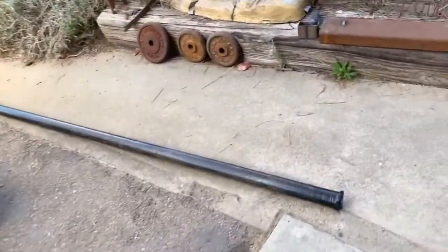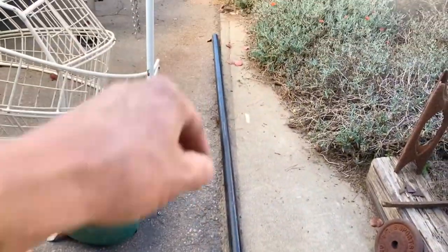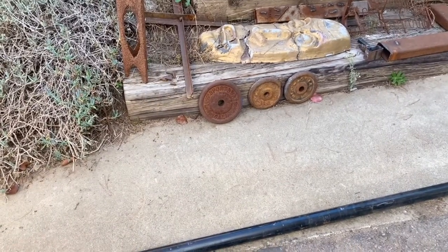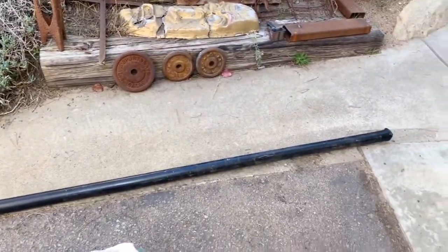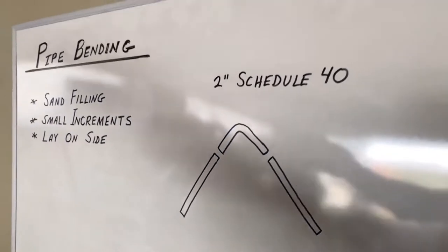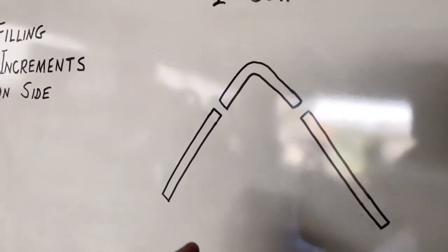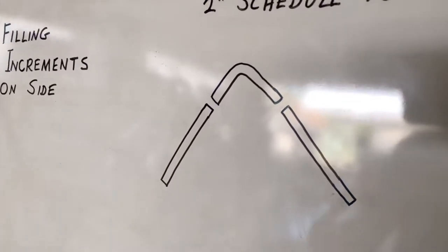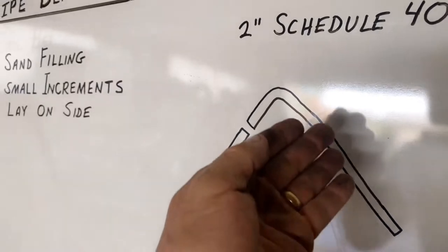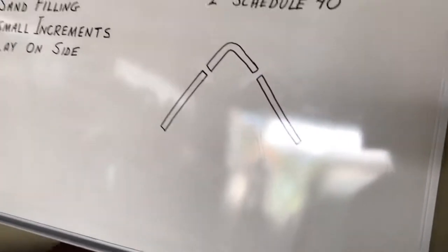I already capped one end with cardboard and a bunch of electrical tape, so it's really solid. This is 10 feet long and the goal is to bend it right in the middle around the five-foot mark — like a 45 to 90 degrees. I made a shorter piece, about two feet long, which will be easier to fill with sand. If I can get my bend how I want, I'm going to weld the other two pieces on, then grind and dress the welds so you won't even tell.